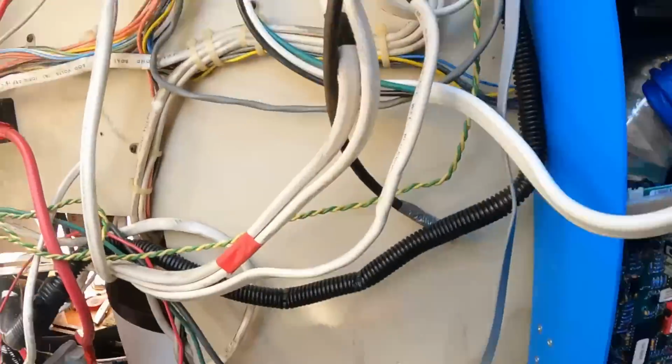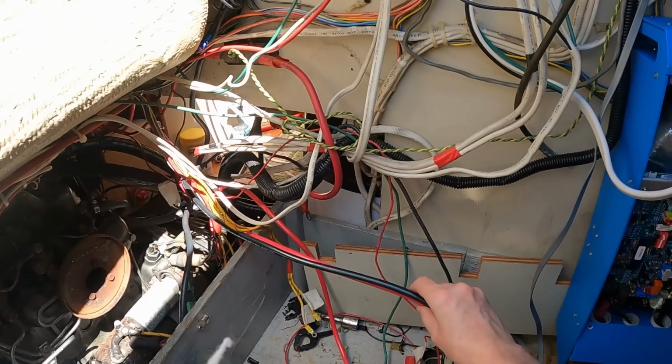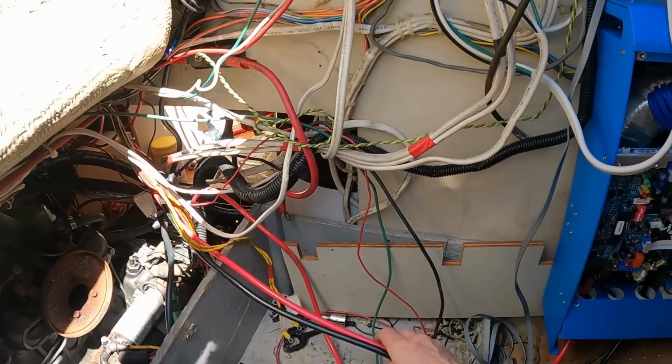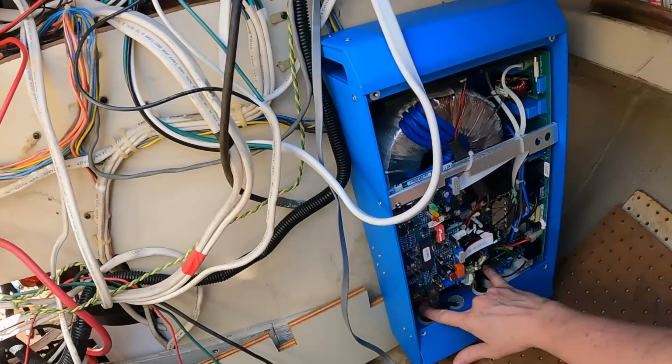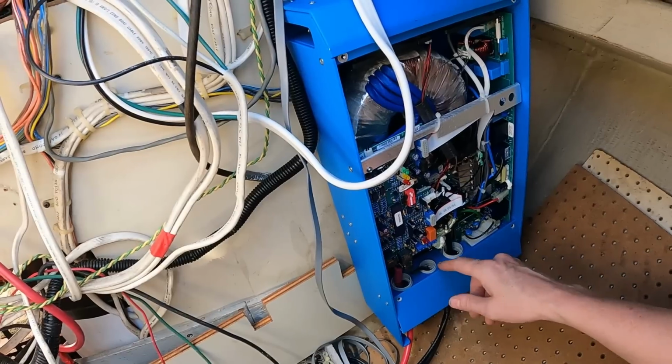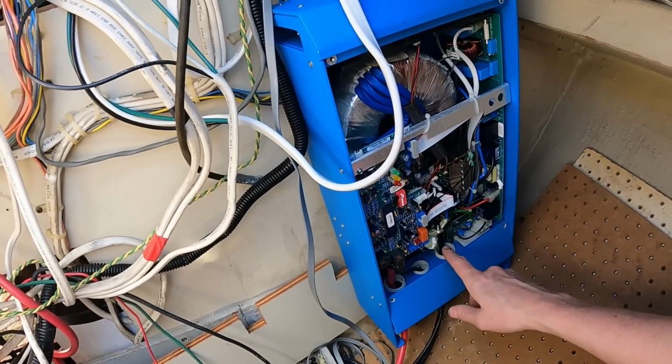Problem is, I could pull up to 120 amps easily. 4-gauge wire is not going to cut it because that's going to be over 2 meters of run, over 6 feet of run. So I need to make new wires out of 1 gauge. Voltage drop got down to 2% at 120 amps at that point.